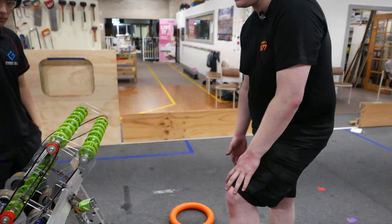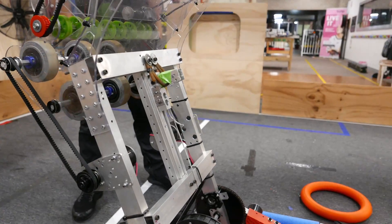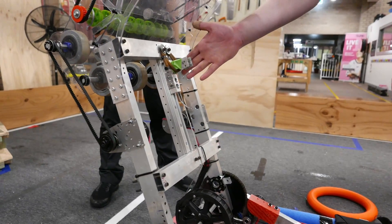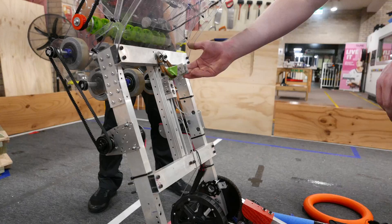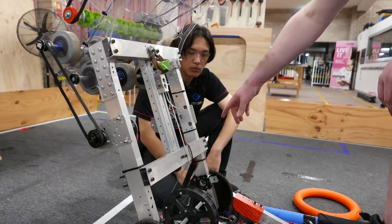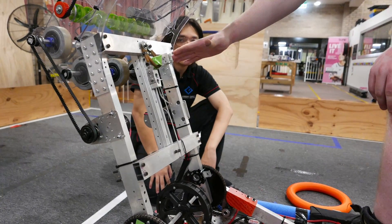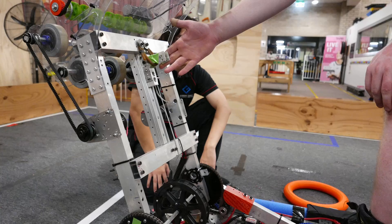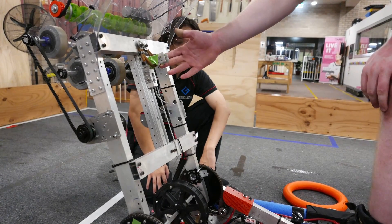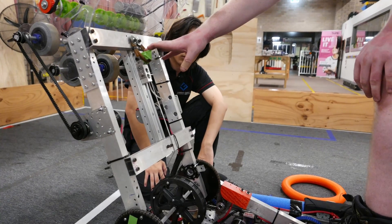With our climber, we wanted to have something as simple as possible just mounted to the arm. When we tried to climb, we had our hook location pretty much here. When we climbed, though, our center of gravity was way too far back, and so we twisted and the bumpers on the back were running against the ground. We knew that we couldn't really change the height of this hook when we climbed to attach onto the chain because it comes in about here. So we had to find a way to move the hook.